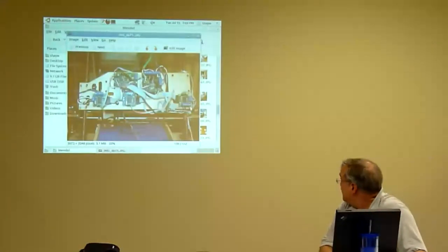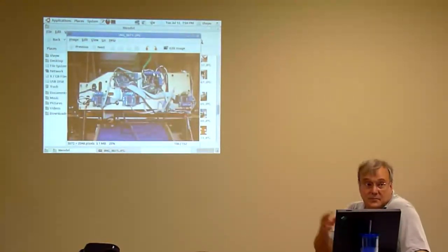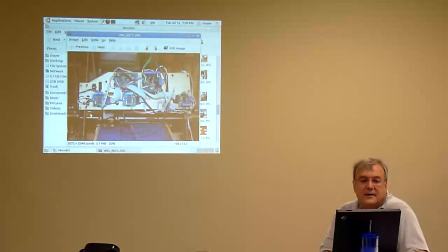These are the electronics. This is the board that has the firmware in it and the main controller. It's powered by a USB, which has a little USB to RS-232 converter right here, or 485, I'm not sure. And then it talks to this board. This board runs the extruder. So it runs a stepper motor that feeds the filament in, and then up here it also feeds in the heating element and the temperature sensor, so that it knows when to turn the heat off and on. And then these down here are the stepper motor controllers for the X, Y, and Z axis.